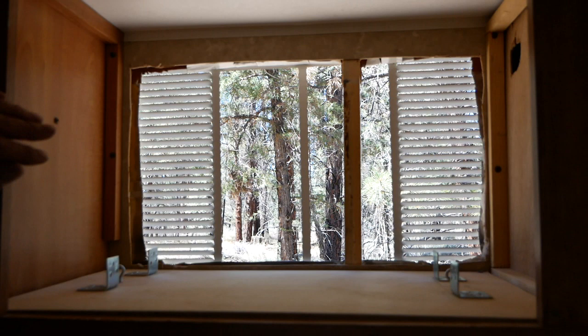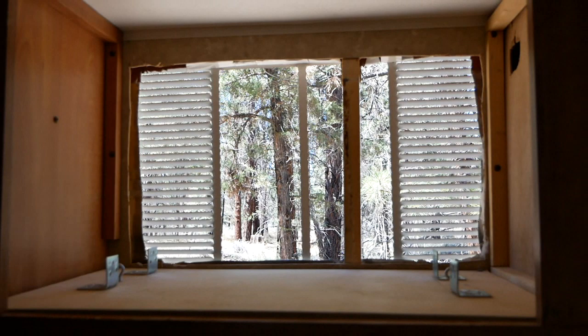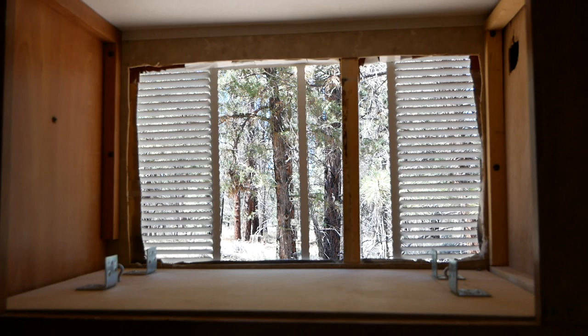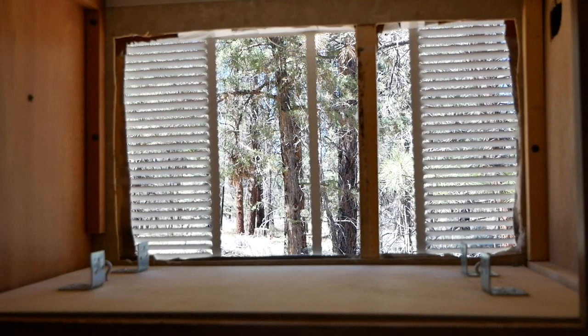These are L brackets that sit on either side of the air conditioner to hold it in place. These are eye hooks that I use with a really heavy-duty bungee cord to keep it set down. It holds it in there incredibly tight. I don't have a drain cut in simply because the condensation is blown up against the fan, which blows it out over the condenser unit. That helps keep the condenser cooler. It's one of the features of the air conditioner.